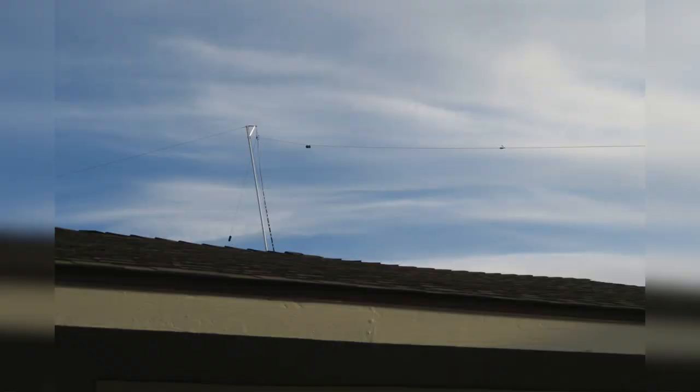So let's talk about antenna manipulations. I have a G5RV. A G5RV is basically a dipole — either horizontal or inverted V, however you want to assemble it — with a balanced feed line, in this case a ladder line. It's called twin lead: two wires separated by a little plastic piece in the middle. That whole feed line piece is active, balanced, and resonant. It is going to be affected by things in and around its space — metal, flashing, things that could affect any antenna. It's going to affect the G5RV, particularly that vertical piece.